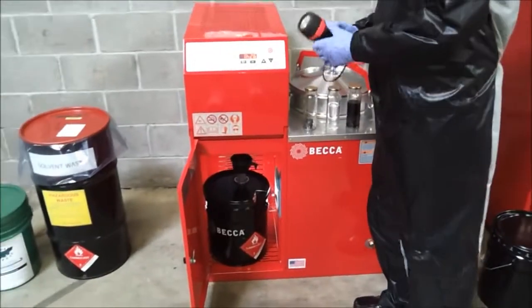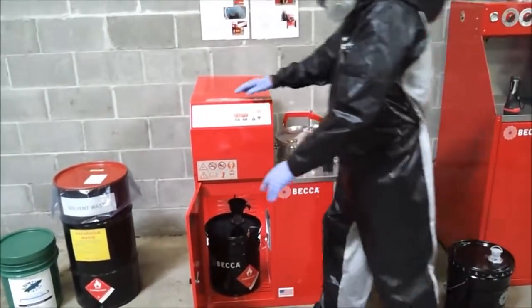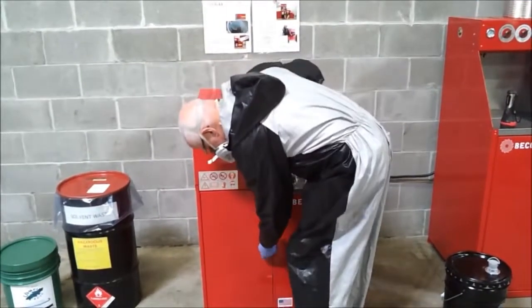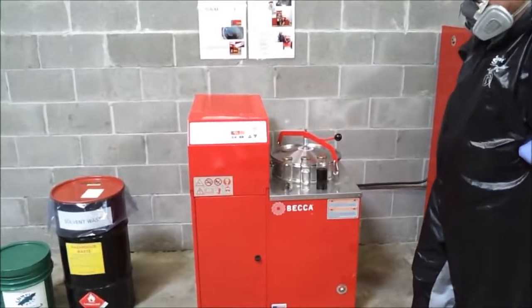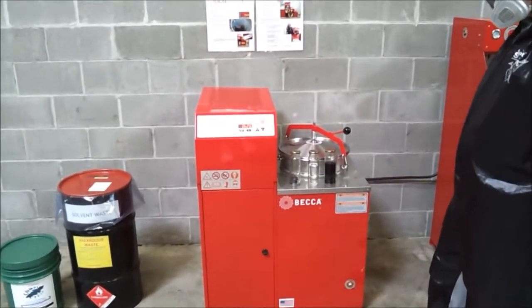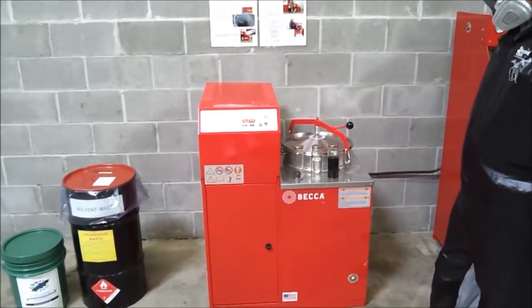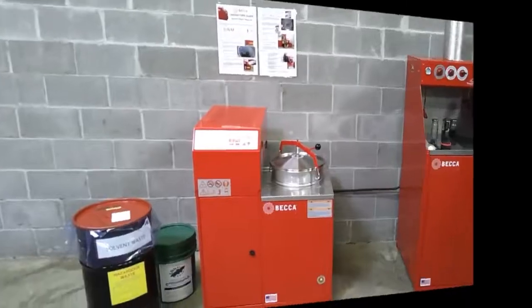The amount of available solvent recovered in this process can be as high as 99%, depending on factors such as the type of solvent, type of paint, volume of paint in the used solvent, and the time and temperature setting of the distiller. As a general rule, the purity and content of the blend of the recycled solvent is directly related to the blend just prior to distillation.